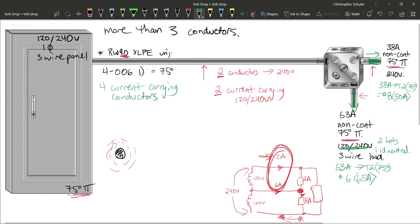Note that if we were sizing the conduit, that neutral conductor would count — we'd have five conductors total — but when determining ampacities and sizing branch circuits, the neutral does not apply. Rule 4-004 Subrule 1 Item C tells us to go to Table 5C, which gives correction factors for more than three conductors in a conduit. With four to six conductors, the correction factor is 0.8 — meaning any conductor selected will have an ampacity of 80 percent of its Table 2 rating.